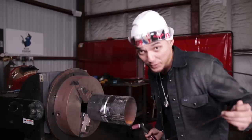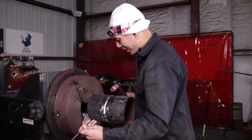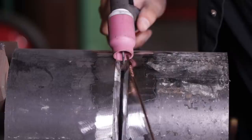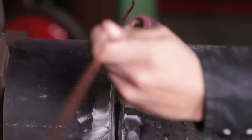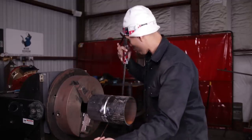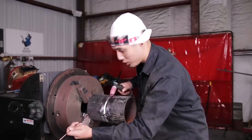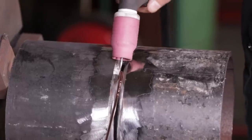We're not starting from the bottom - this is not fixed position. I'm not going from the bottom to the top. This is fast production, this is why they have rollouts. I like my tacks to be on top, and I like to have my TIG torch up here while welding. If you're up here, you do not have to backfeed. With rollout there's no need to backfeed - you don't have to have the rod on the inside. Gravity plays when you're on the top side at 12 o'clock. All you got to do is run hot, have the wire in there, and lay wire it all the way through.